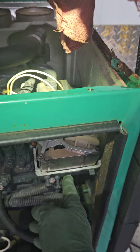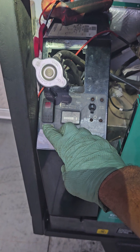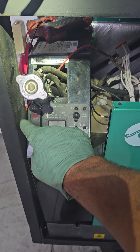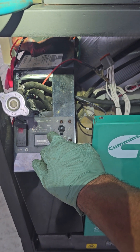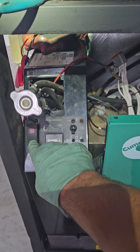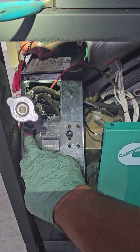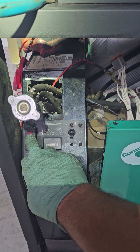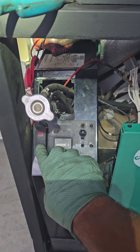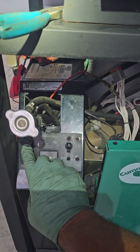The injector pump actuator is this component here, but I'm going to go through the whole process. The battery is disconnected and this is the battery switch. There are plenty of videos on how to pull codes, but essentially if you try to start it and it blinks and it's not one of the main codes — one, two, or three — then it's called a secondary. For a secondary, you do another push and it gives you a Morse code: the first digit is one through five, then a pause, then one through nine. When I did that, I got one blink, a pause, and then nine blinks, which is Code 19 — injector pump actuator.